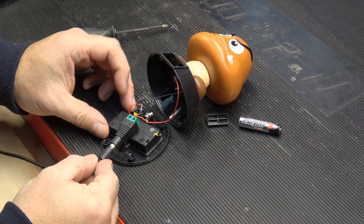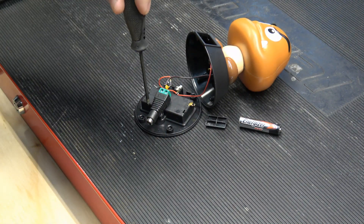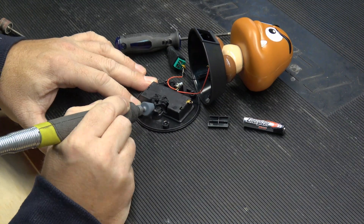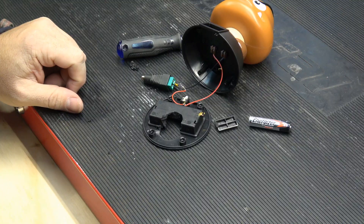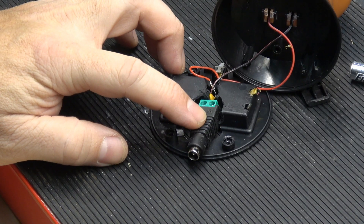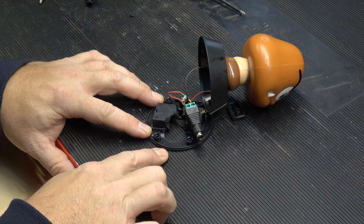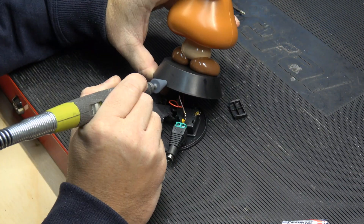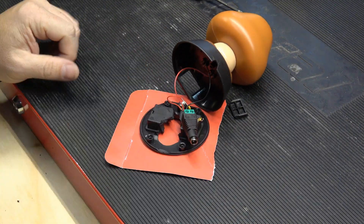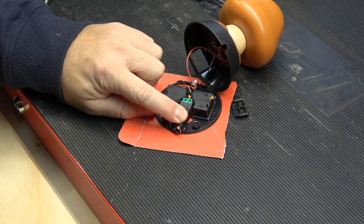So what we need to figure out now is how to mount this adapter. I'm going to use a rotary tool and just cut away at the outer section of the battery box — make a little slot in it so that the power supply will still sit flush on the bottom. Now we have a nice hole, and that actually worked very well. It didn't gum up the little stone or anything. The adapter can sit right there, the wires can be contained. I'm going to notch out a little bit of the ridge and make a hole on the back side for the cable. Then I'll use some hot glue — putting a piece of cardboard from the box underneath so I don't get any glue on my toolbox — put a dab of glue right there and sit the adapter in it and wait for it to dry.